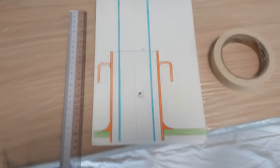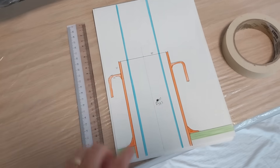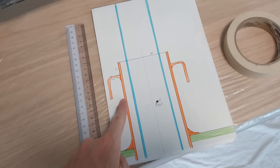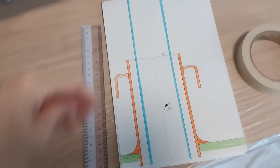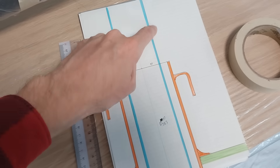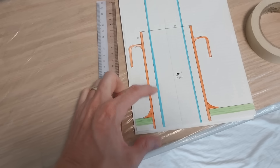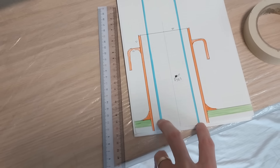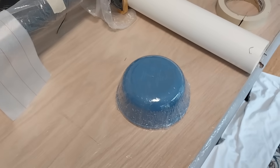To help with building these parts I've sketched them out in one-to-one scale. In blue is the mast at its current thickness, the orange is the mast tube, and the green is the deck. The wave diverter is designed so that if a wave sloshes on deck, it runs up the mast tube, gets caught in this trap, and flows back down. I'm also going to have a rain diverter that attaches to the mast here, so any rain or splashes of seawater coming down the mast get diverted over this way. I'm going to carbon fiber this bowl to make my rain diverter.